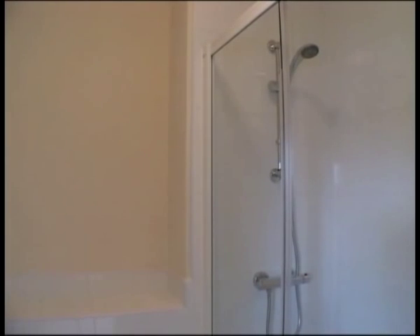One area that needs special consideration is any area that contains a bath or shower. How has the 17th edition changed installations in this sort of area? The new regulations now state that all circuits within a bathroom, shower room, or en suite need to be protected by a 30mA RCD. Are there any other changes from the 16th edition? The RCD rating and circuits comply with the new regulations, because there's no need for as much supplementary bonding as there used to be.